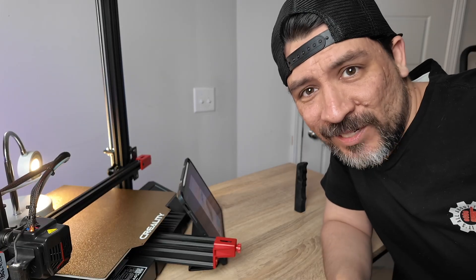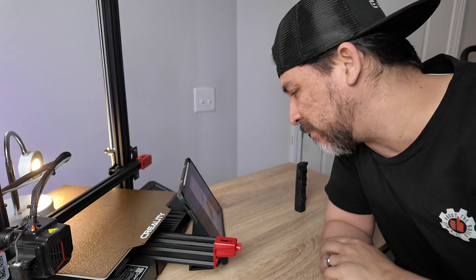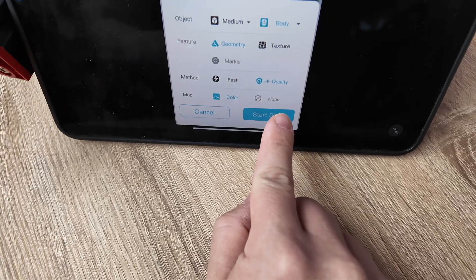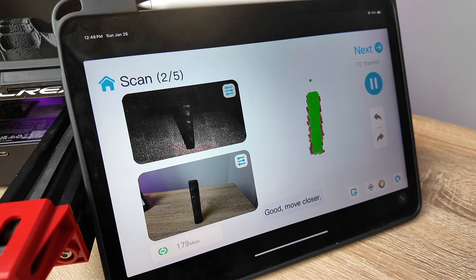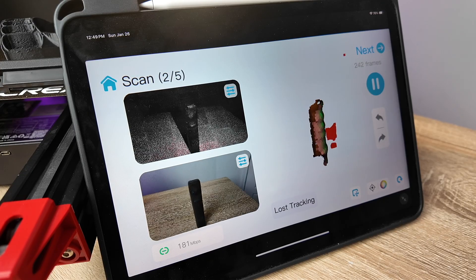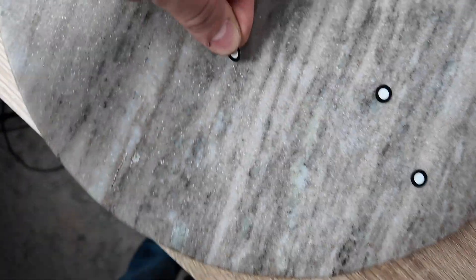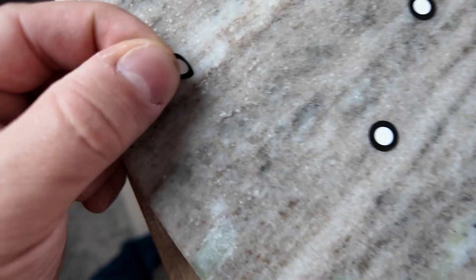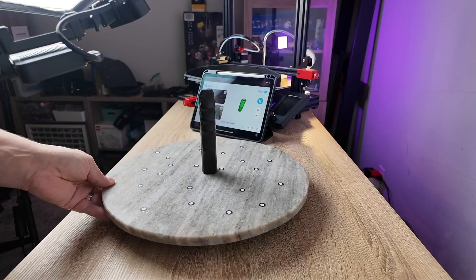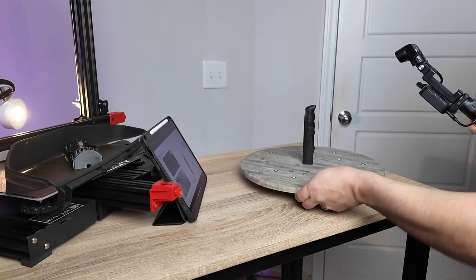This isn't as easy as everybody else makes it look, but let's try a few different settings and see what happens. We cancelled the scan and selected geometry instead of texture. The settings helped a little but we were still struggling. However, there's one more setting we can try — using these markers which keep track of positioning. So we added a few markers to our surface along with the turntable, then placed the part in the center and started scanning while rotating the turntable.